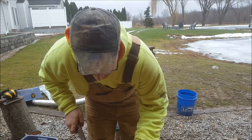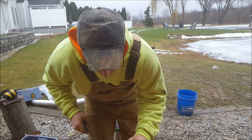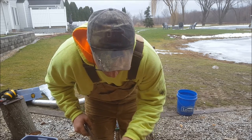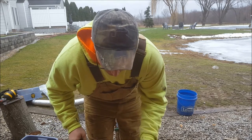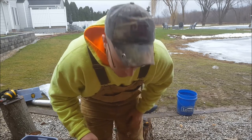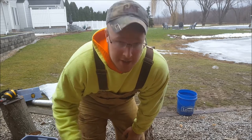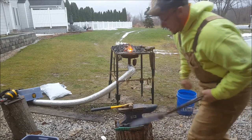We're keeping it the same thickness for right now. What I'll do is take and hit this with the hammer in a striking motion and actually draw that edge into it — so you don't have to grind it in there. You can grind it, I suppose, but I like drawing it out. It's more blacksmithing, I guess.